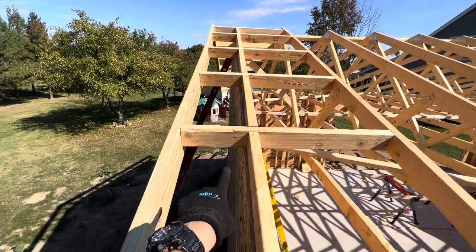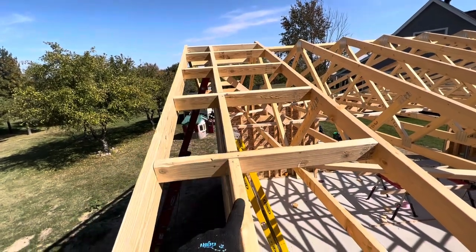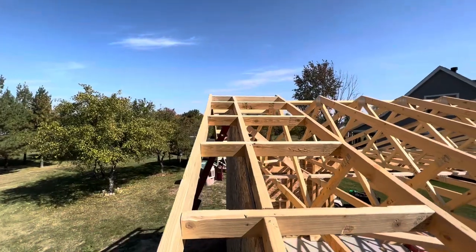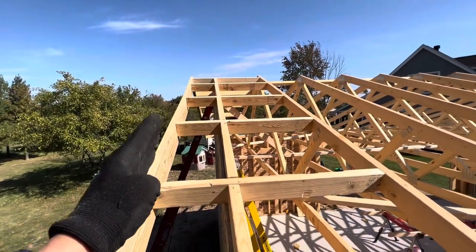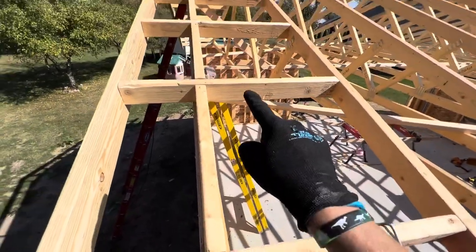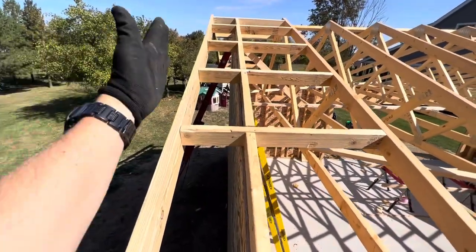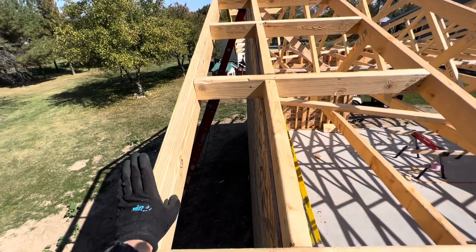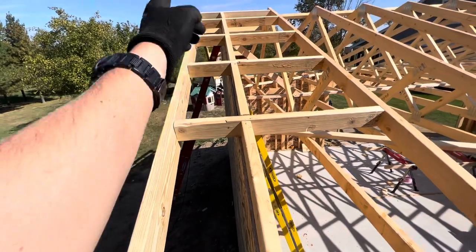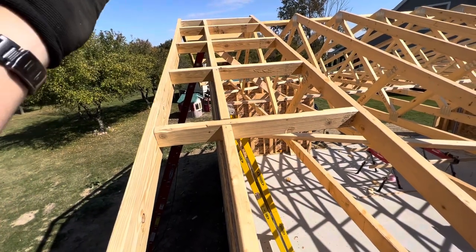Run purlins from your first structural truss so they overlap this gable truss. As you work your way down, put these spacers in — they'll space you equally down the row and keep the purlins from twisting over time. The fascia board was really warped — actually it was bowed out at the top. That's why you don't put it on first. Build each purlin exactly the same length, get your blocking done, then slap your fascia on.